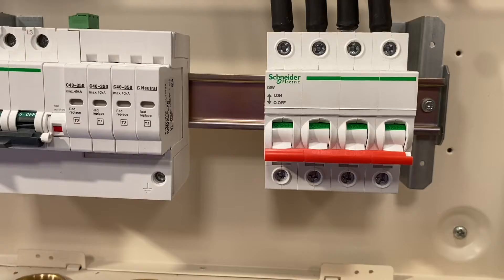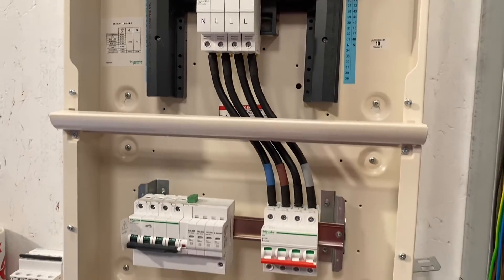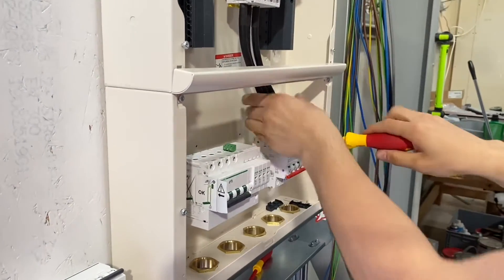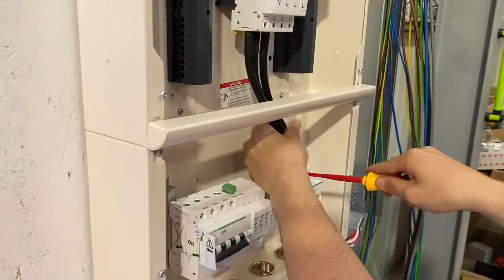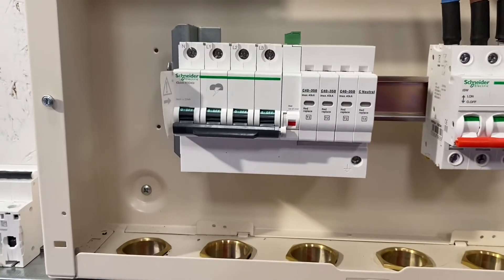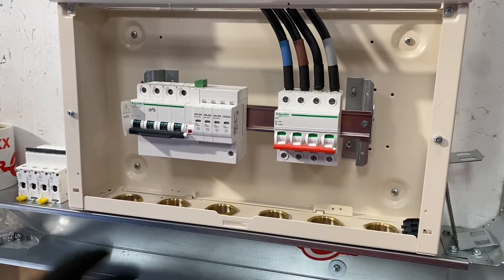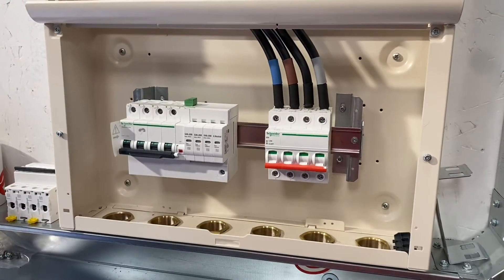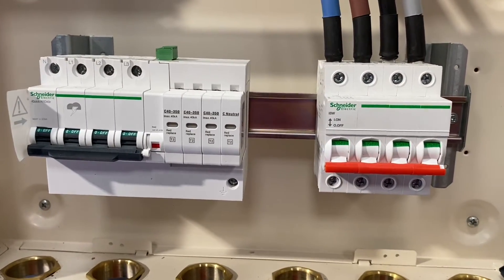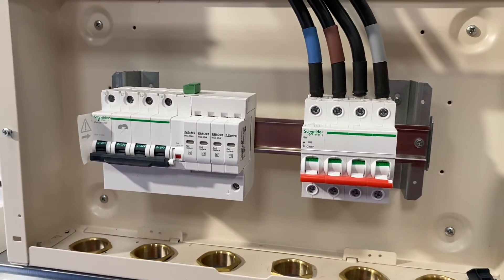So this is the main incoming switch and they're the flexible connections you've made for the DB, colour coordinated. I think I've found another little secret you've got there — I can see the surge protection device there. How is that going to be connected in relationship to the incoming supply? That would be paralleled from the surge protection over to the isolator. Okay, well we've had a look at that and I think that deserves a standalone video, so we're going to do that separately. It will be in the link in the description or the eye above the screen.